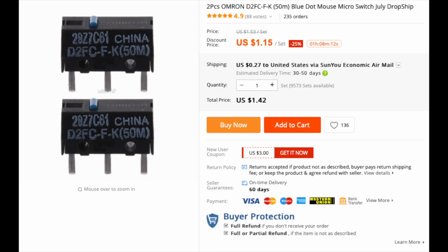But you could just go ahead and swap it out for the same switch after it wears out. But if it's because of electrical conditions within the mouse that are not letting the switch live its proper lifespan, then you're only going to get a couple months of life out of these after all. So switching from like the 50 million cycle ones back to the 20 million or the 10 million or even the 5 or 3s might do better for you.